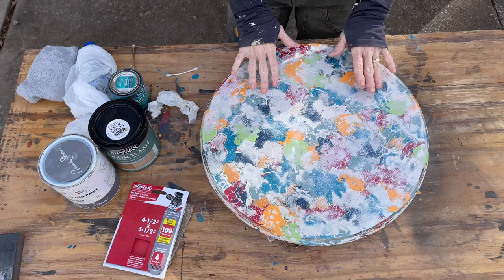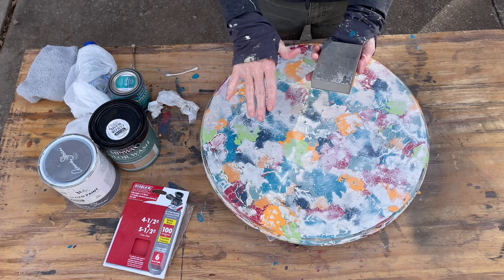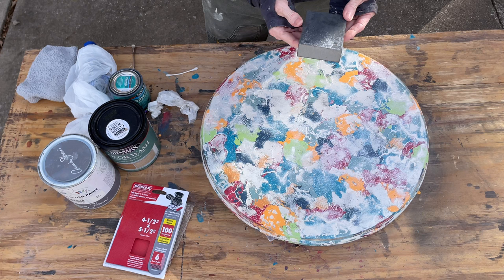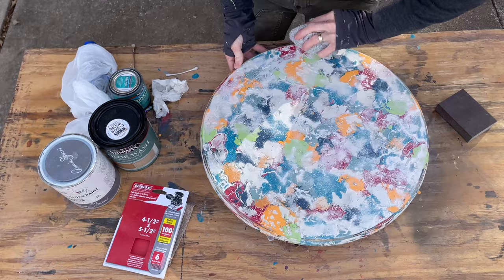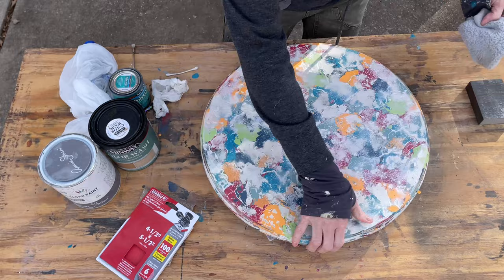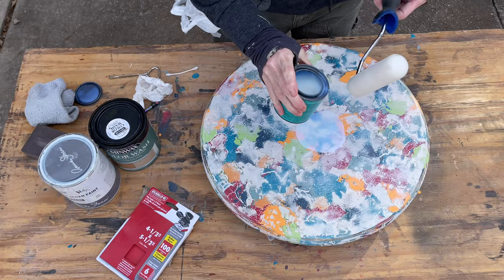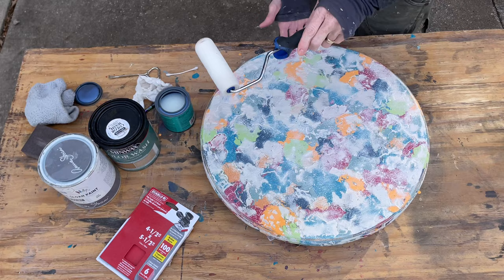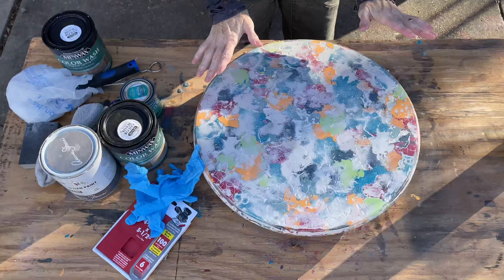We're dry and going to do another coat. Between coats I like to take either 400 or 600-grit sandpaper and very gently do a light scrape — just making it a little bit smoother. Go straight across with a flat hand, one or two passes, and that baby's going to be smooth. I keep my rollers in a Walmart bag to keep them moist if I'm doing another coat the same day. That's the second coat — we're doing three total.